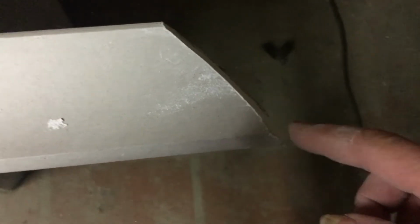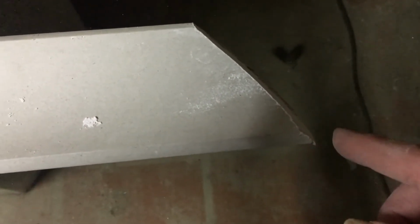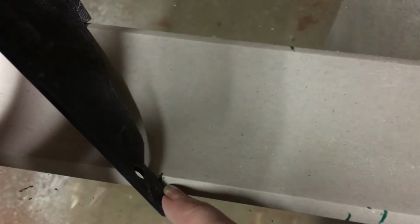to long. So now what you're doing is you're measuring the length of the wall, so you measure from that point to the point where you need to cut, and then just cut like that. After checking that the cornices all fit properly, I've marked where I'm going to be gluing them in. So now I'm going to mix up some of the cornice cement and start gluing them in.